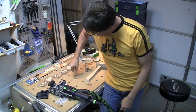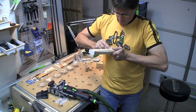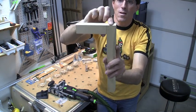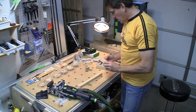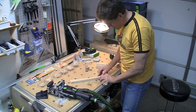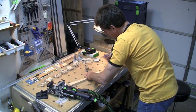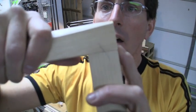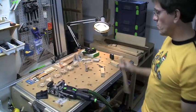Slide the Domino into one end, push it into the other — there you go, a nice clean joint. That is pretty close to dead-on. Now I'll do the other side, making an intentionally very crooked layout line to show it doesn't matter. All I care about is where it intersects this edge and that edge.